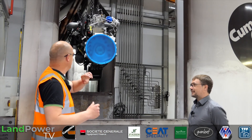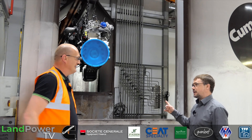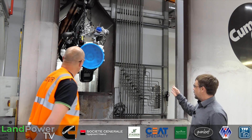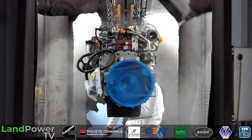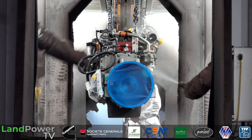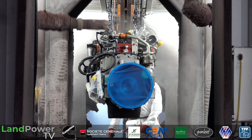So Andy, it looks like we're literally watching this engine that we've just seen in the prep process - that's about to get painted now. So we've got a two-stage paint process, we've got two ABB robots, and they'll spray the engine first on the easier-to-get-to parts. As you can see, there's a lot of different bits and pieces hanging off the engine at this point, and it's challenging for the robot to get into all the gaps.